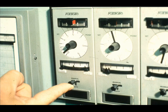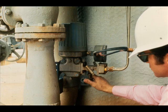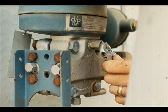If the transmitter is in a control loop, the controller must be placed on manual. Remove the transmitter from service by closing the high and low pressure impulse valves at the meter manifold and opening the equalizing valve. We will change the range from 0 to 50 inches to 0 to 100 inches. The field range change should be within the limitations of the contained capsule.